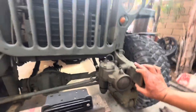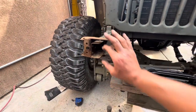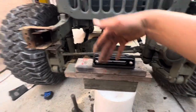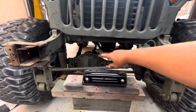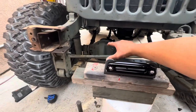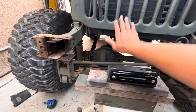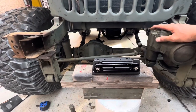I've gotta go to the metal supplier and get a 1x2 to come across here. With some 3/16ths plate I'll tie into this, and then tie into that, and I'll probably put a gusset because it's gonna go up at about a 25-degree angle — so a gusset will make it a little bit stronger.